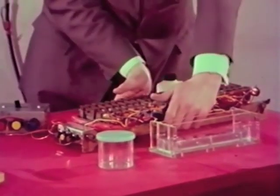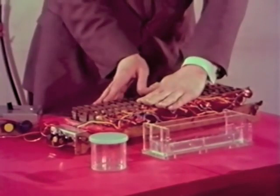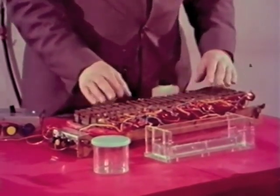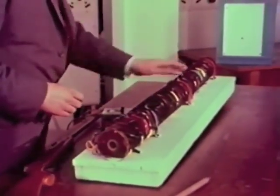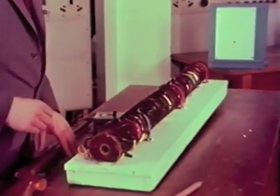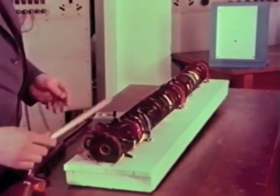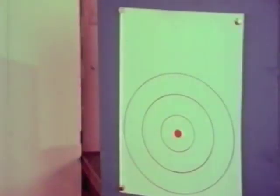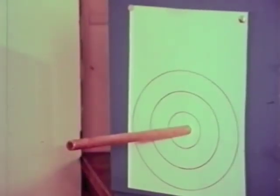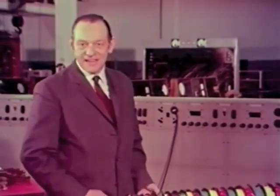Can you imagine that the two sides were bent upwards and the whole thing rolled up into a tube? Having imagined that to be done, let's make a machine that looks like that. We should find that the windings are very simple — only a row of coils like this. The moving part is a steel rod with a copper sleeve around it. We put it in the end of the tube and fire — well, that wasn't a bad shot, was it!